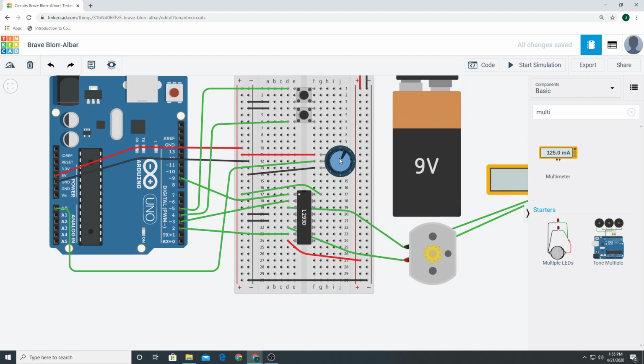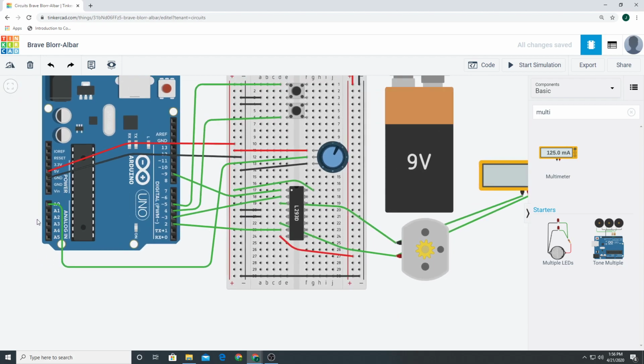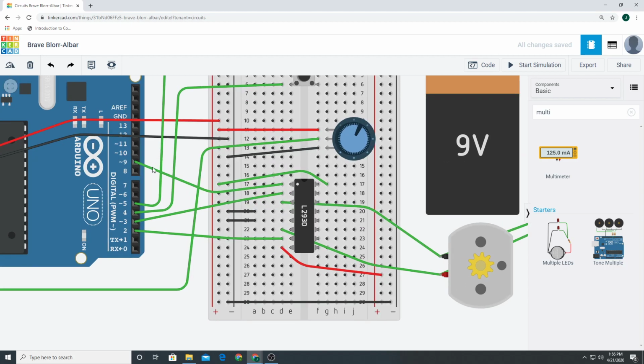So what's going to happen is, if the thing is on, it's going to read this value coming in from A0. It's going to divide it by 4, because when you do an analog read, it reads it between 0 and 1023. If I divide 1023 by 4, I get 255 approximately. Really close, right? So what I'll do is I divide it by 4, and then I'll send the signal out through either output 1, which is going to the motor right here.